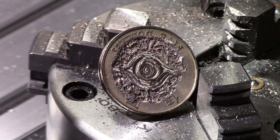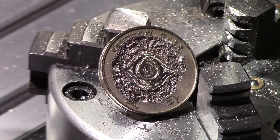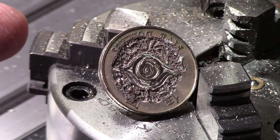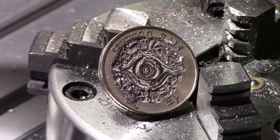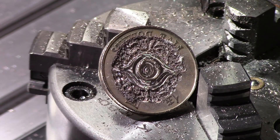The other thing with these coins is I really have no clue what they're made out of, so it's very difficult to say this is such-and-such aluminum or mild steel and give you the speeds and feeds. This coin went into a lot harder than the Malaysian coin did, which is another dynamic I have to take into account. On a softer coin, the speeds, feeds, and 0.25mm depth cut might be fine, but this coin is probably much harder.